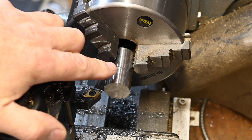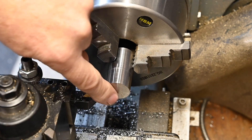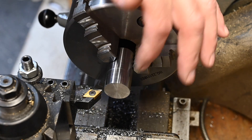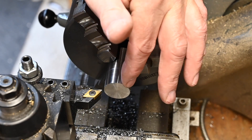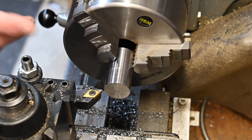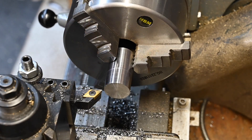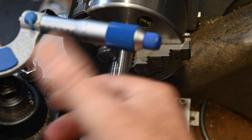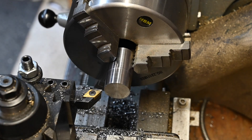I've got that cleaned up. I've got the DRO set on the face now, so I can turn that down to my dimension which is 24mm diameter and 8mm in. We're about 25mm so we need a millimetre off of that.